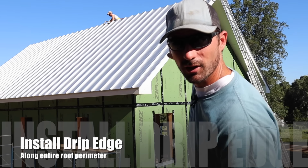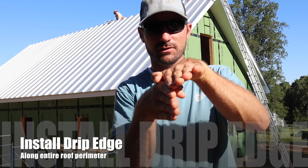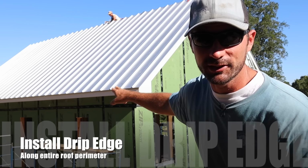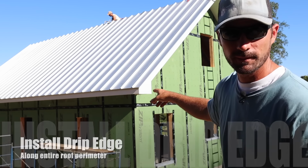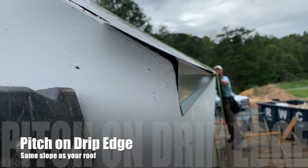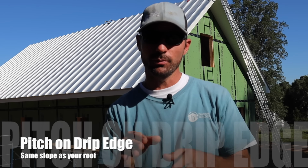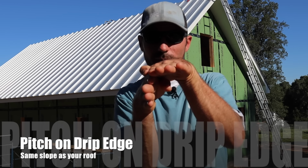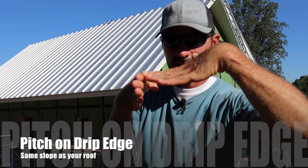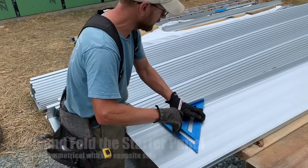For this rake that goes up right here, that's going to be a square drip edge. It's going to be bent at 90 degrees because it's following the roof pitch all the way down. For the drip line down here, we have a 10 and 12 pitch on this gable roof. And so we want to bend that drip edge so that it's plumb, because we got plumb cut fascia, and the top edge is going to have that 40-degree slope for that 10 and 12. That's really important, because if you try to put a square drip edge on a pitched roof, it's going to go like this, and then what's going to happen is it's going to make a dip at the end, and it's going to pull your metal roof panels up like that.